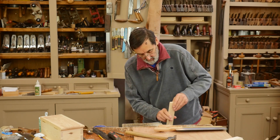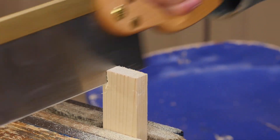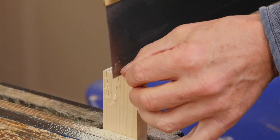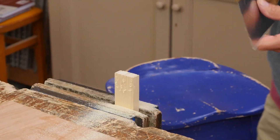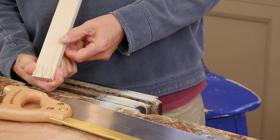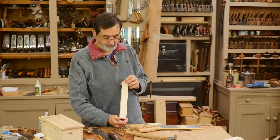See what I have at this end here. Dovetails — does that work? Works great. So that's taken off the heavier set, made it a little bit more refined, and it's very uniform and very smooth in the cut. So it's an ideal way for setting small tooth saws. Perfect.